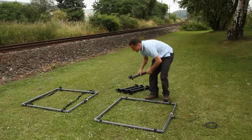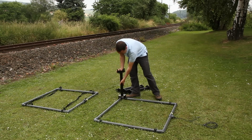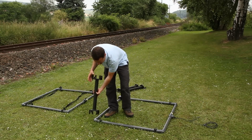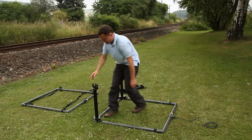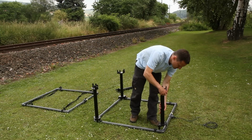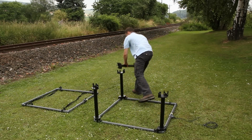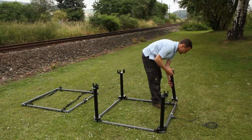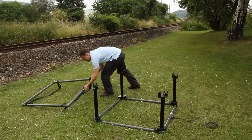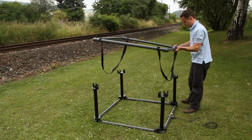This specially designed double frame coil consists of 2 coils working electrically in opposing directions. Thus suppressing interferences, for example from power cables. In order to achieve this, make sure that the marks on both coils point in the same direction and that the lower coil is connected with the marked connector of the Y-shaped adapter cable.